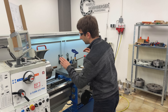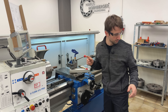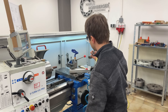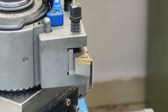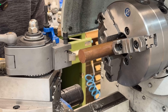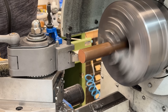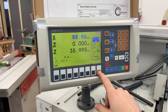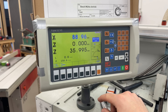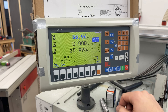I've never turned any copper before and I think the best thing I can do is just treat it like aluminum. That's also the only thing I can do. So first, switching to an aluminum insert. I'm setting up the constant cutting speed — setting the diameter and my target cutting speed. Let's go with 150 meters per minute; max RPM let's go with 2200. That should be it.